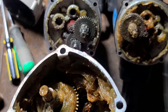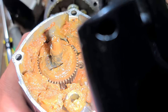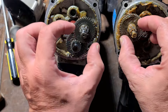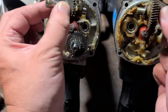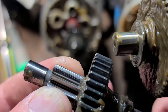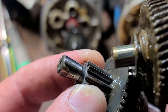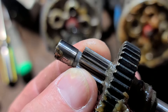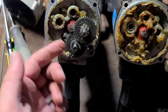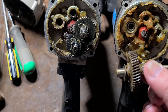On the left one it almost seems like there's some moisture that got in there — it's a bit red, almost like a little bit of rust, but maybe that's just the grease. I'll pull out these two final drives and make sure I don't lose my little washers. You can see the second stage coming in and then the third stage — they make the gears much wider with much more engagement area and thicker teeth as it progressively gets more leverage because of the increasing gear ratio.